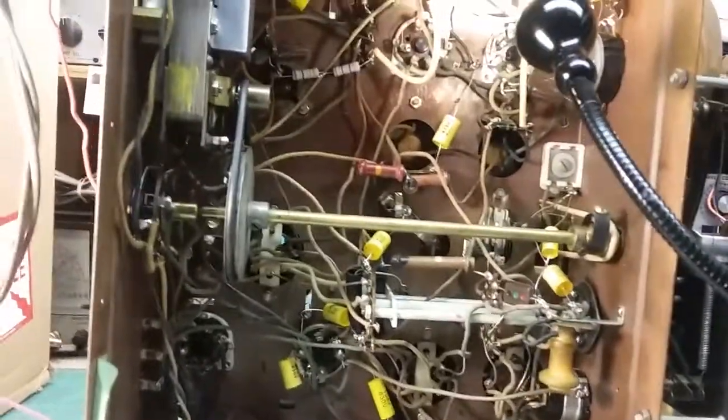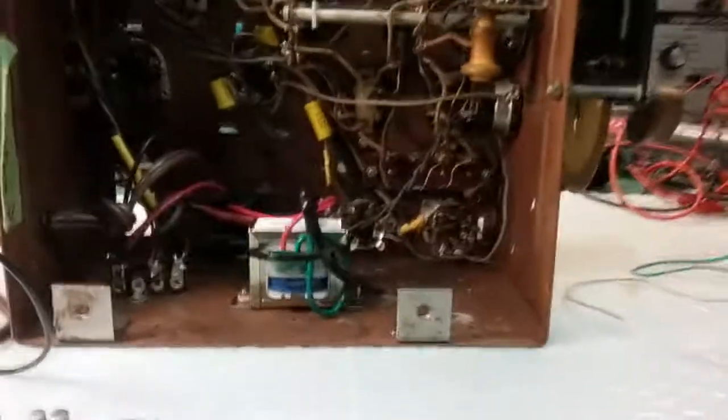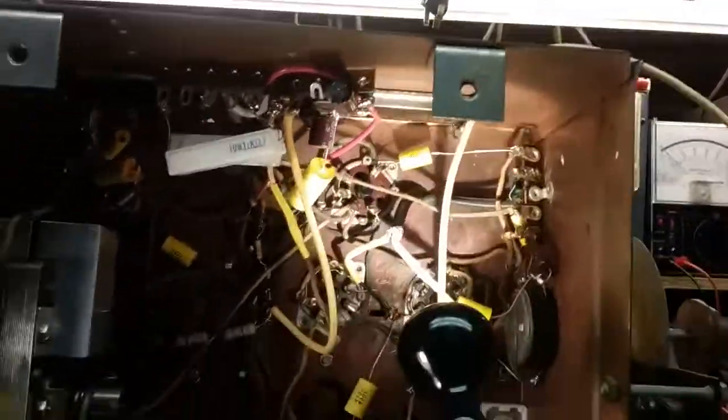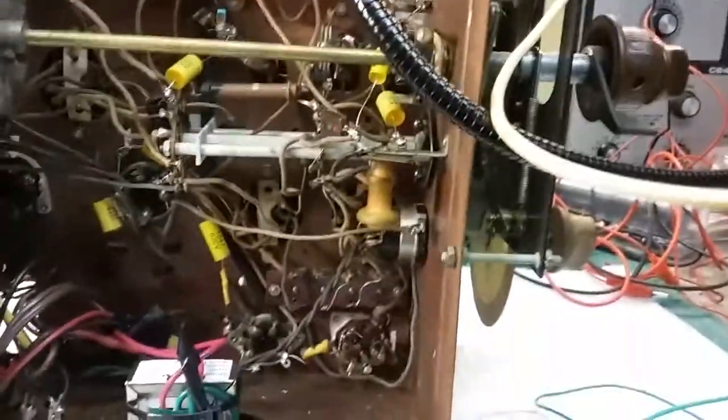I got the belt on the motor. That turns the motor one way, that turns it the other way, and of course that spins the dial around. And then this is the fine-tuner. I ran a shielded cable out and ran a single wire out for the input, which is fine - it's not picking up any noise. Coming through the side of the chassis, it's not near any AC lines. The shielded wire is the input back to the volume control and the tube. So I can switch this over to Bluetooth and play music to it.